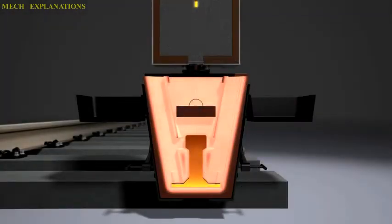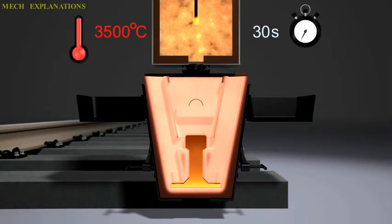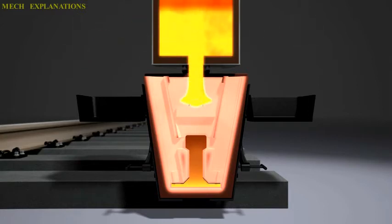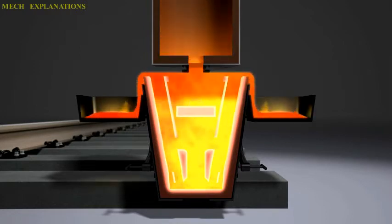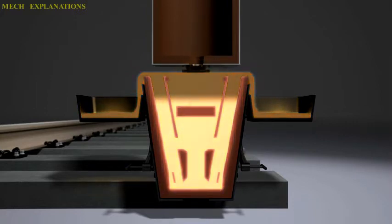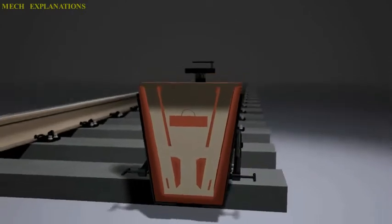Commonly, the reacting composition is five parts iron oxide red — rust — powder and three parts aluminium powder by weight, ignited at high temperatures. A strongly exothermic, heat-generating reaction occurs that through reduction and oxidation produces a white-hot mass of molten iron and a slag of refractory aluminium oxide.